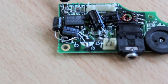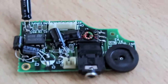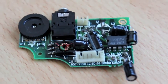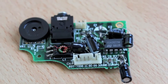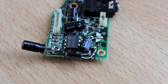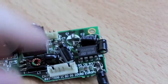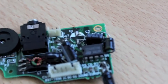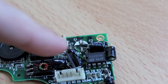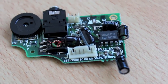Soundboard's all done. So you can see it doesn't really have a lot of space on it. But they're on there. So hopefully it'll work. Just always remember that negative goes toward the white part, because the positive needs more room. Bigger gap is positive. There's also a little plus near them, but it's a much easier way for me to remember it anyway.